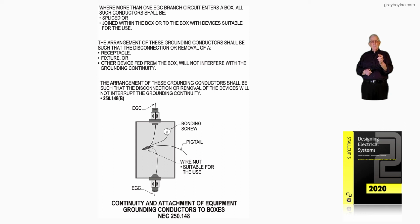So this isolation equipment ground shall not be connected to the receptacle frame or box in accordance with 250.146(D) as in dog or 406.3(D) as in dog. And notice you'd have an equipment ground in this case, which would be green, and you would have more than likely an equipment ground with a yellow tracer in it to indicate that it was an IEGC ground and not an EGC ground.